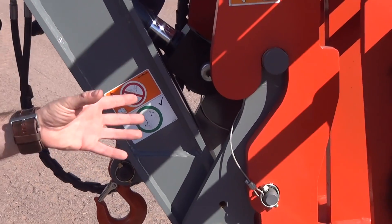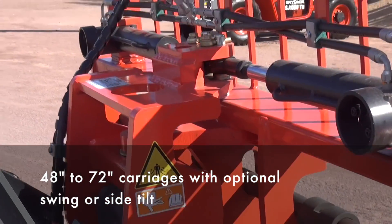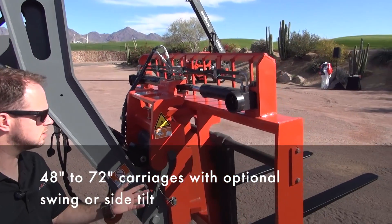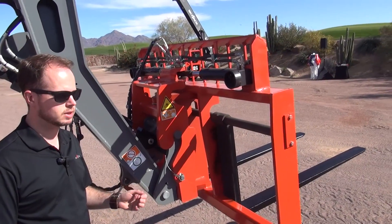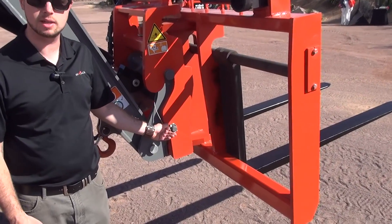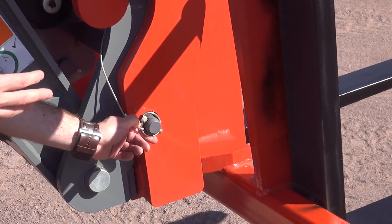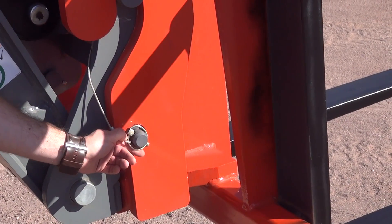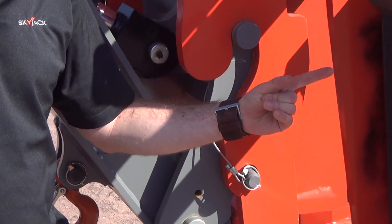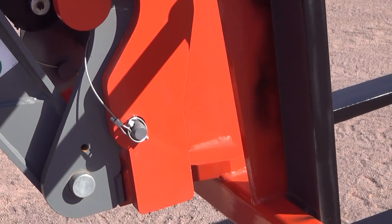This machine has an optional 72-inch swing carriage, available across the range. We have 48- to 72-inch tilt carriages as well, as well as the standard 48- to 72-inch floating pin carriage that's fixed. In order to change carriages, we believe we're the simplest in the market. We have two short pins on each side secured with grenade pins that are always set up as retention pins — not fully under load and can be removed with the carriage at any point. Other telehandlers require you to carefully lift the load off these pins, or have one long pin that goes all the way through, or a spring retention system. These are extremely simple and very easy to remove and replace.